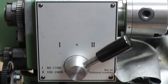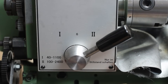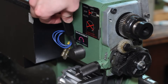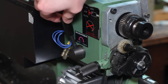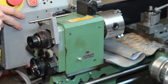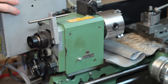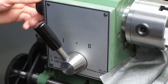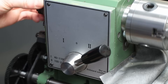Next, I changed the gear lever to the front side of the machine. Originally it was on the back side of the headstock, and on the front side there was an electrical box. The gear lever was really hard to reach from the back side, and I had plannings about installing a proper electrical cabinet there, so I changed the lever to the front side. This has also proven to be a really good decision, as I am switching between the two gears quite often.